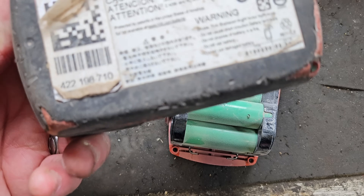So these two end banks are lower than the rest. That's not far enough to do much harm, but that's at the lower end of the scale and the rest of them are at the higher end. That sort of half a volt difference is so important. So what we've got to do is bring this bank of cells up to 4 volts.